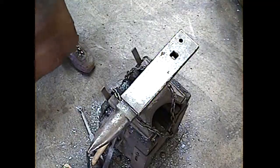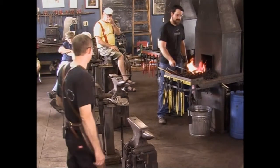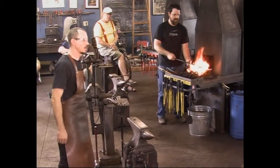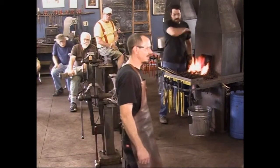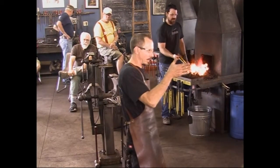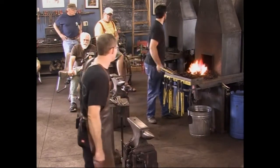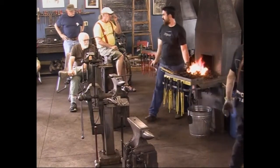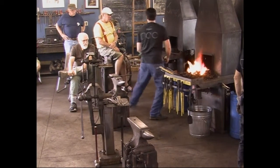I guess it would be a good idea to make a real good butcher for this job. Something to use with a sledgehammer. It's the nature of the butcher partly, and also the fact that my eye, when I'm holding it, it looks straight up and down and it kicks out. And when it looks like I'm tipped way bad, it bites in. Because you're straight up one side and beveled on the other, when you hit centered on the butcher, you're not centered over the cut. Right.